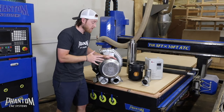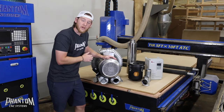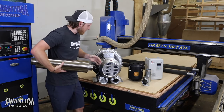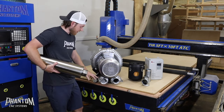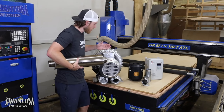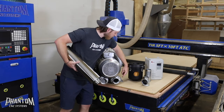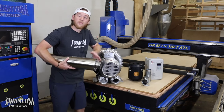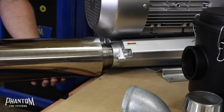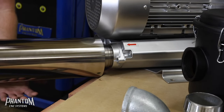The first thing I'm going to show you is how to hook up all of your piping, canister, and mufflers to your vacuum pump. The easiest thing to start with is the muffler. On the left side and right side of your vacuum pump you'll see arrows indicating airflow direction. When you're standing at the rear of the vacuum pump, the right side is going to have an arrow pointing out — that's where your muffler goes. It just screws right into the fitting built onto your pump.